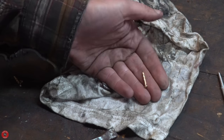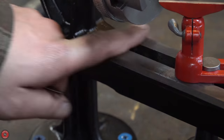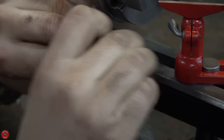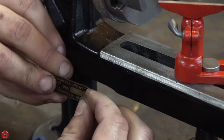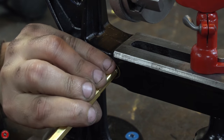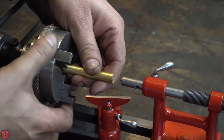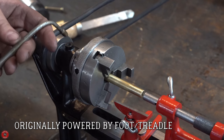Here's how I redid the pins that hold the tag — just two domed brass nails, which work perfectly. I'm brightening up the tag just a little with some quadruple-zero steel wool. That's what I use for all my brass plates; it doesn't take the paint off and gives a little shine to the brass. I have a hard time shining brass up too much as I think it really ruins the collector value or look. I know some would say a restoration technically ruins it anyway, but aesthetically I just prefer not to have super shiny brass — it doesn't match the age of the tool.